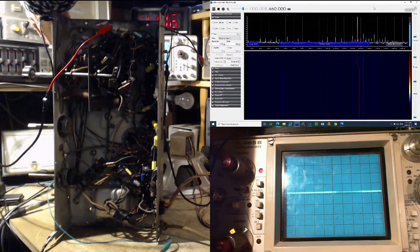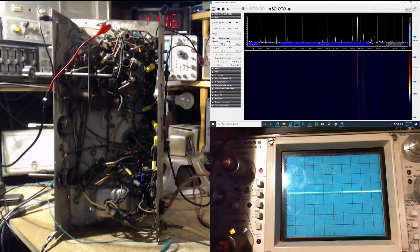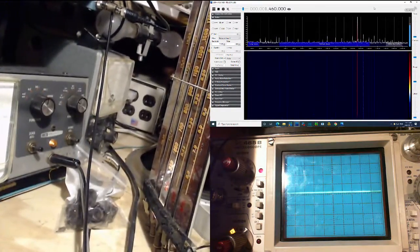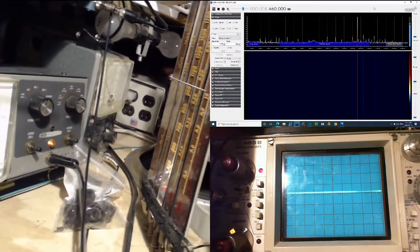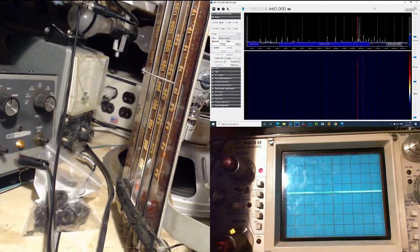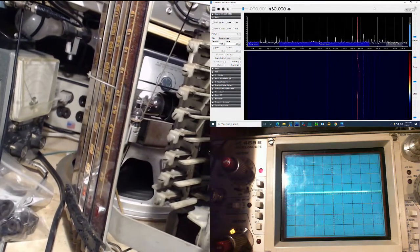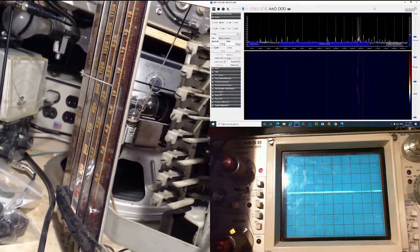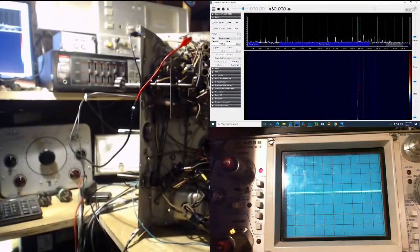The radio is really picking up 1 million hertz now. But the dial, a little awkward to do this, the dial showing just under 900. No, I'm reading that wrong. Oh, it's really, really close. That's a million. Not that far out, is it? It's not as far out as I thought. So it'd be pretty easy to move the local oscillator. Put this right on a million. So now the local oscillator should be 1 million plus 460.